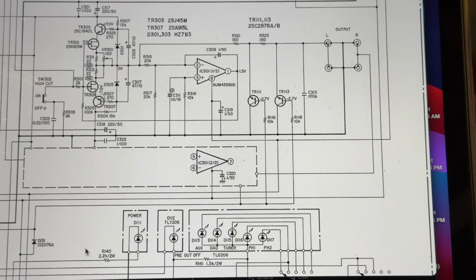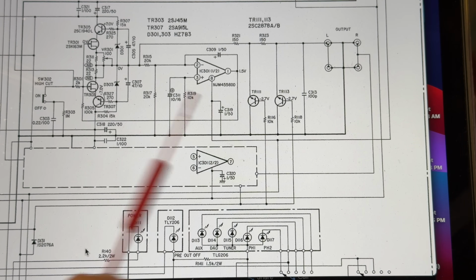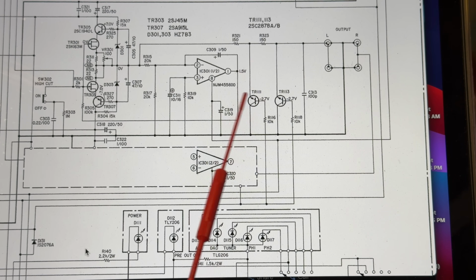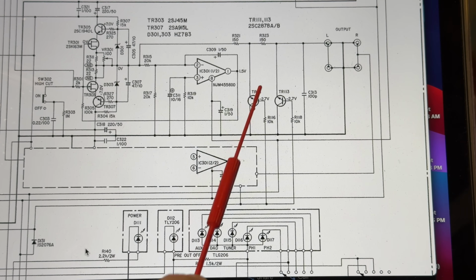If they test bad, we'll know kind of what the issue is right away, but if these both test good, it could be that one of them is only faulty when it's in a certain operating condition. So to figure that out, I will take these suspected bad transistors, move them into this channel, and move the good channel's transistors into this one, and see if the issue follows.